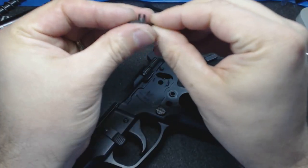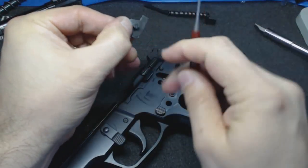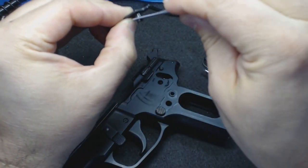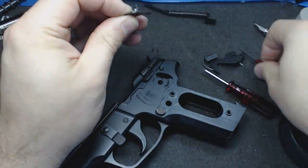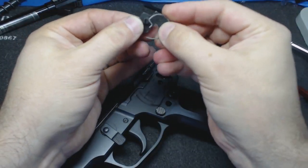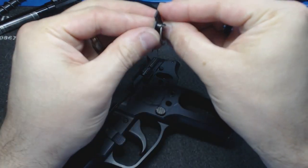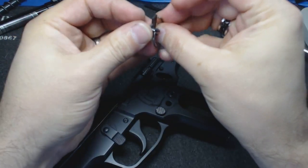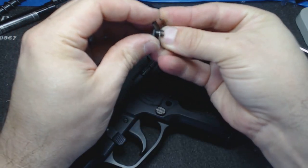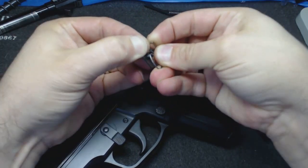So here was what I was talking about on the side view. Like I said, this isn't just a straight cut down into that cylinder. As well as a straight cut, they've made a side cut, and a side cut over here. And that's the whole mechanism that lets this one spring essentially become its own locking mechanism. When this spring sits in here and starts to be rotated, those ends on the top and bottom slide into those locking grooves, and once they're there, the spring can't come off of that metal.